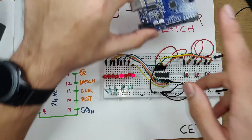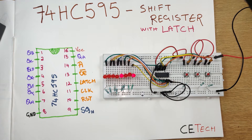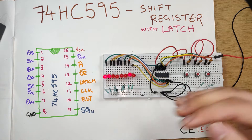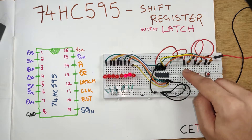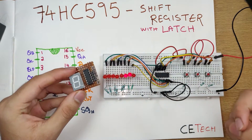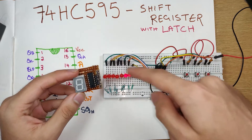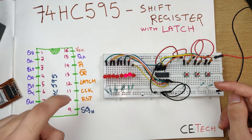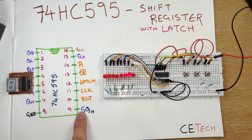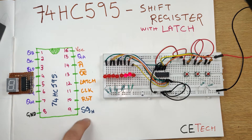When used with an Arduino or a proper electronic circuit, this debouncing problem does not occur, since clock cycles are generated by crystal oscillators or your Arduino. That makes it very fast — you will see thousands of LEDs shifting within a millisecond. Let's play with this a bit more. Like this, you can light up the segments in your seven segment display using your Arduino. The only three pins you need for this to happen are the latch, the input pin, and the clock pin. You can also use the output enable and reset pins, and to daisy chain 74HC595s you can use the QH' pin, which is the serial data output pin.